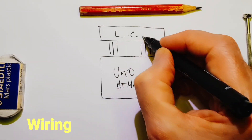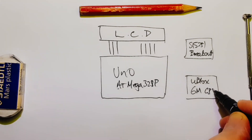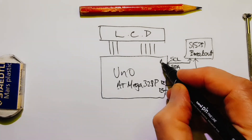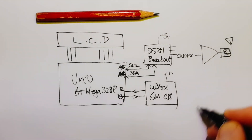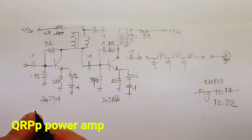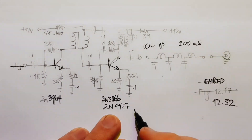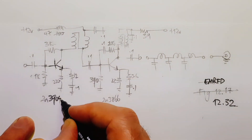The wiring is so simple it can be done on a breadboard. The UNO is wired up to an LCD in the usual way. It talks serial via D2 and D3 to the U-blox, and I2C to the SI5351 breakout, which drives a QRP power amplifier and low-pass filter to the antenna.